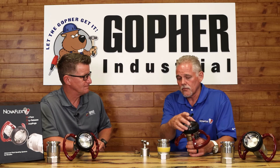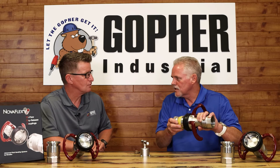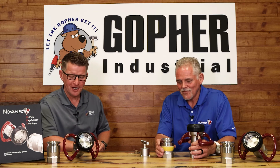One of the things about this fitting from a safety standpoint — especially offshore where you're dealing with a lot of different chemicals in close proximity that you don't want cross-contaminated — is selectivity positions. We can configure both the female and the male so that this female will only connect with its corresponding male; you cannot connect it to the wrong valve. Along with that, we do color coordination — yellow handles with a yellow stripe, so people know yellow goes with yellow, red with red, black with black. Then add selectivity so you have both belt and suspenders, making the human error element as minimal as possible.